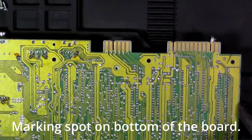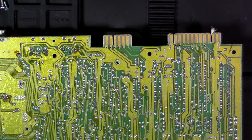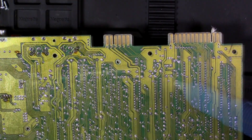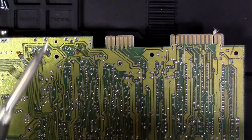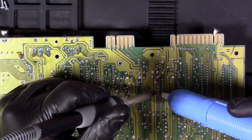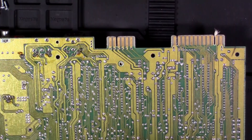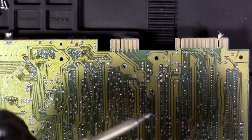Now you'll see where I'm marking that board. I haven't done a million of these and I wanted to make sure I was working with the right two rows of pins, so I put a light mark there so I'd know which ones I was working on, and then I began to desolder them out. Some of these were tricky to get the solder out of. I made sure to use flux sometimes, and then on some I had to add new solder back and then use the sucker again to finally get it all out. On the top I had to do that a bit to get those vias totally clean.